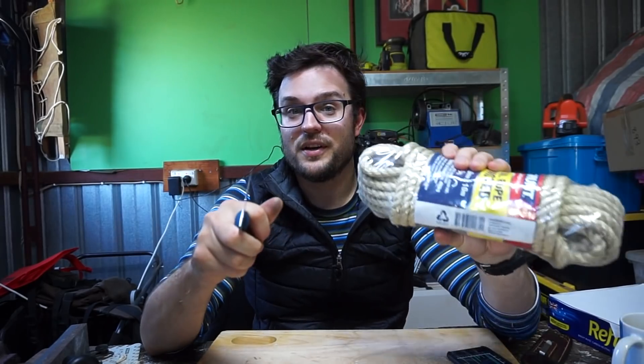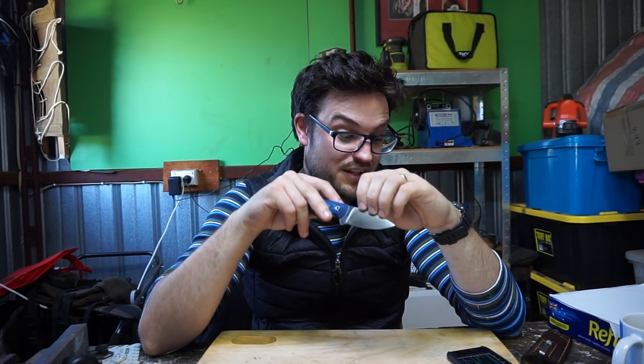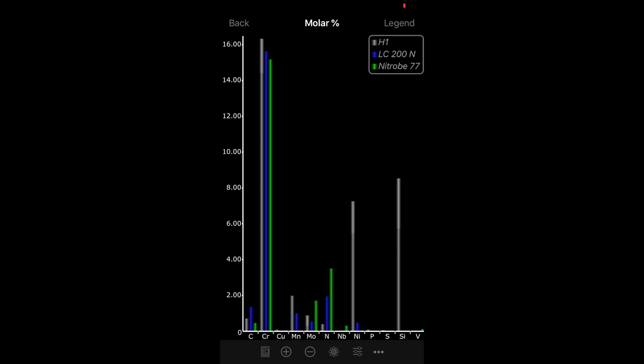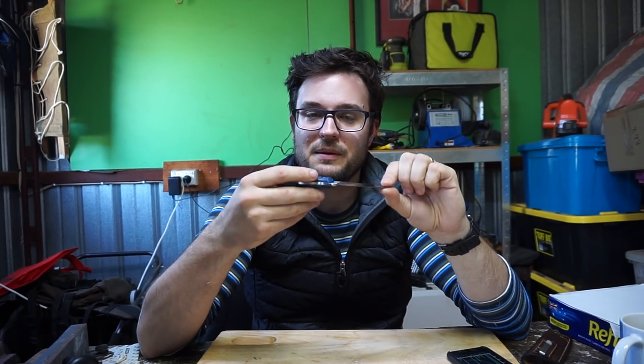So what we're going to do — we're going to grab this blade, we have put a 17-degree mirror-polished edge on it, and we're going to see how many times it cuts through twisted sisal rope before it no longer slices a held sheet of paper. That is hopefully the answer to our question. Looking at the recipe, is it going to perform as well as LC200N? I don't know. Better than H1? Probably. H1 in my experience hasn't had great success — it's just got nothing in it making for hardness or edge stability. It's a purely rust-free steel, which is great, but this one I think has got a bit more effort put into making it a viable edge-retaining steel too.